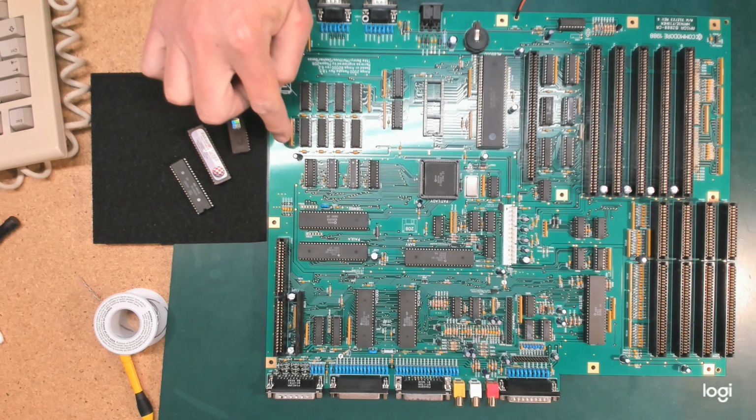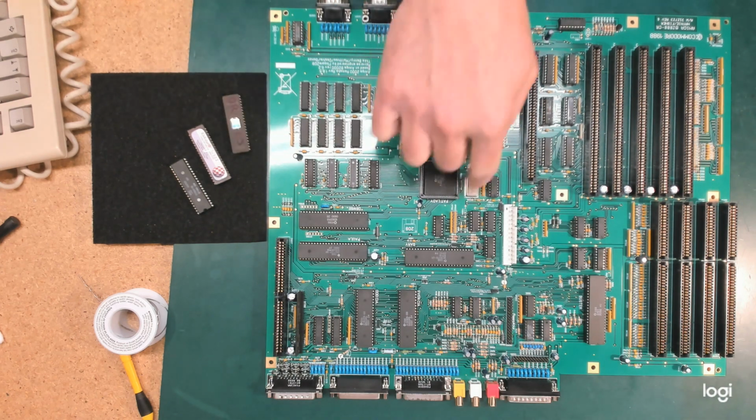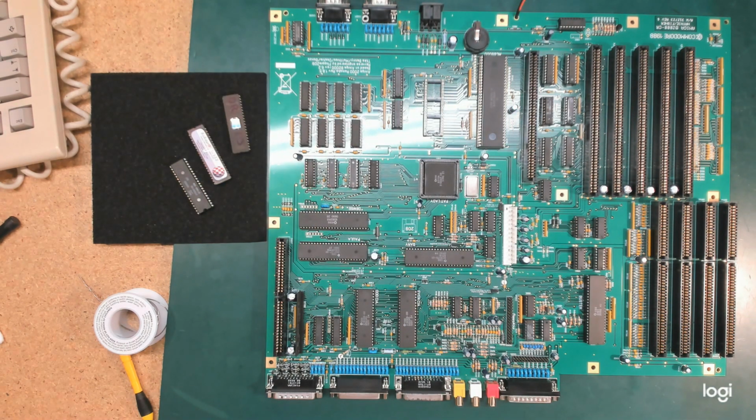It was over here in that RAM chip, and I think that's the first bank. And so even when I swapped them all around and cut back with the jumpers to 512K of chip RAM, the computer wouldn't start. It had a yellow screen.